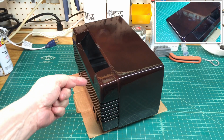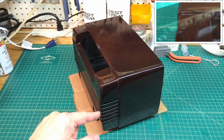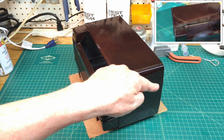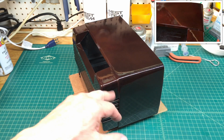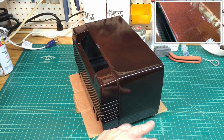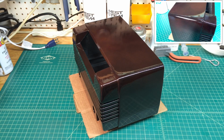This is the area right in here I had to kind of recreate this bottom section, and I had to fill many of these voids here. And having that painter's tape on the side when I put the epoxy underneath actually helped reform this corner, so very little filler was needed. This side actually turned out better than the other side. But again, there's still some things I can do to hide some of the flaws on the other side.